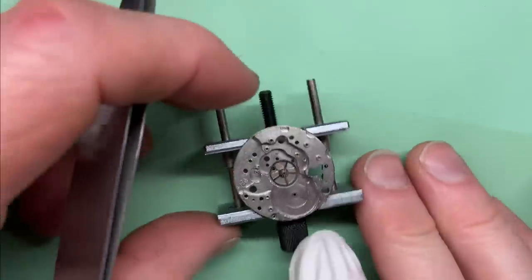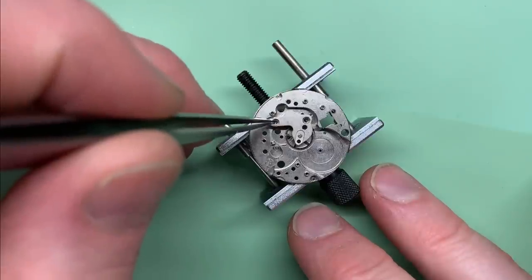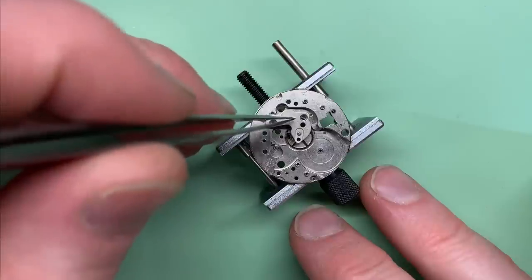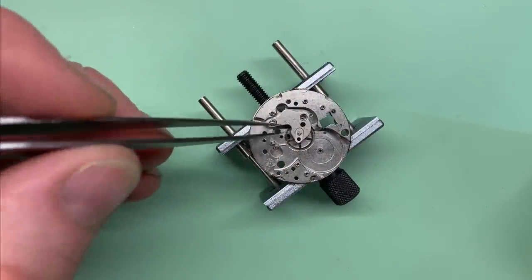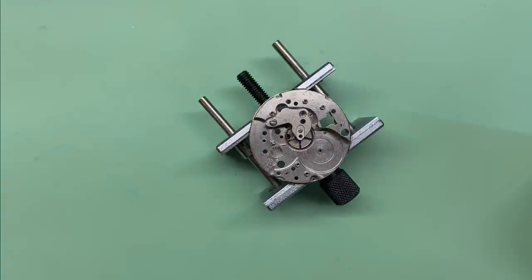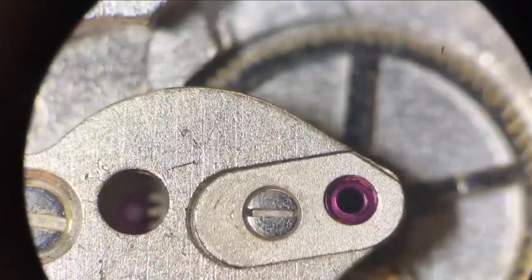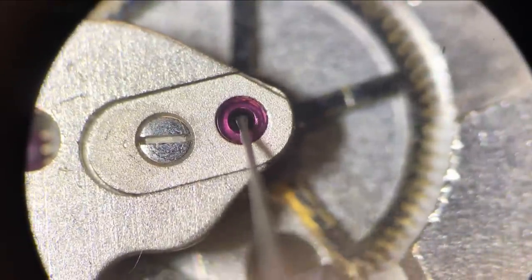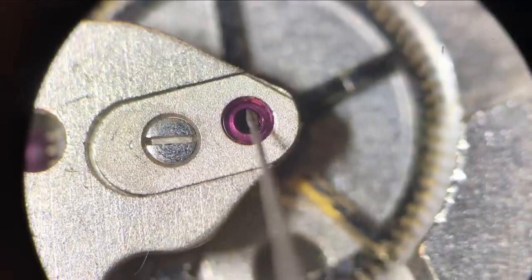So center wheel will drop in. Secured by two screws, although it's not on properly, is it? There we go. Okay, there we go. So I'm now just going to oil the center jewel there. And also what I want to try and do, because I do this on my Seikos, is just put a little bit on there